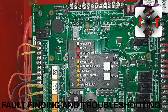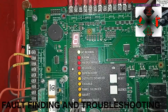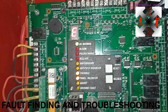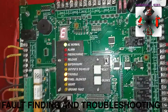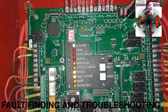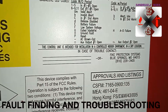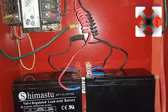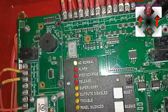I've removed the battery and I can see 'E' on the display along with a blinking trouble indicator. I'm going to silence it — okay, it's now showing panel silenced with a trouble signal, and the 'E' is describing what is happening. If you want to troubleshoot and you see 'E', you come to the code table and look up E — it says: battery failure. That is exactly correct because I removed the battery.